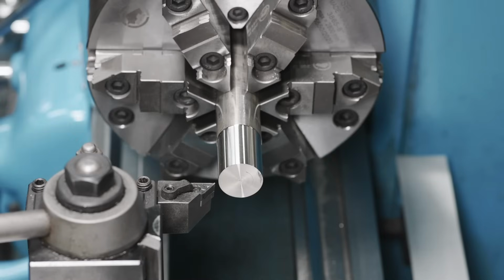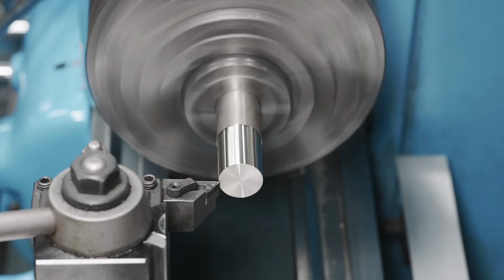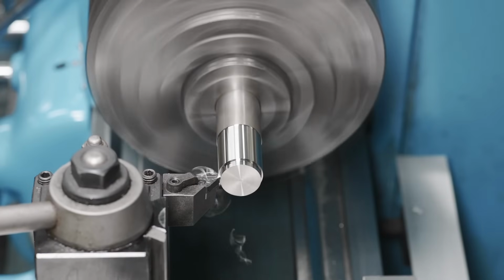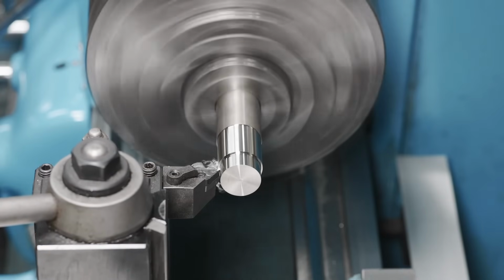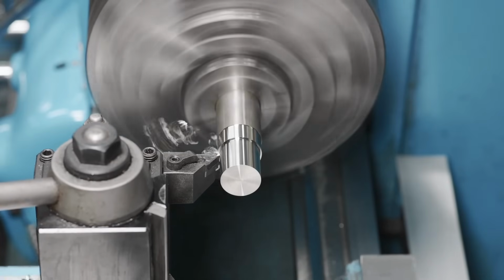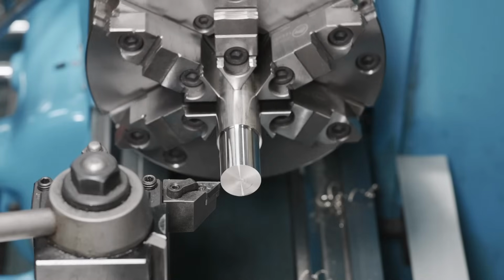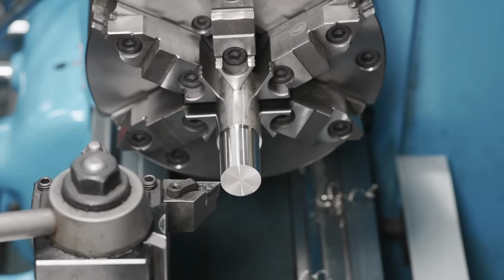All right, that's gonna get us a nice surface finish, but it's a little fast for my liking, so I'm gonna step it down. We're running, looks like 12 thousandths feed rate here, so we're doing a 7 thousandths, we'll try that. And we'll take 100 thousandths off. Oh, look at that, looks nice, looks real nice. Chip control is decent, it's not amazing, but it's good. Surface finish, I can't complain, looks good.